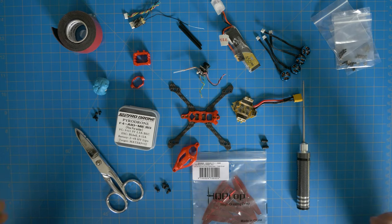It doesn't rip exactly like a five inch — it doesn't have the weight for inertia, that floaty feeling. It's pretty locked in and tight; you've got to stay on the throttle. But it's pretty darn close. I've got the build video ready, there's Betaflight configuration at the end, and I got a little bit of rippage with it. The only downside is I can't figure out how to get a beeper on it — no beacon on the ESCs because it's BLHeli S. All the components are down in the description.